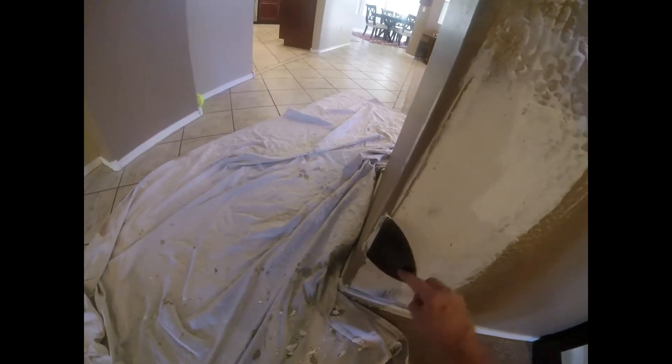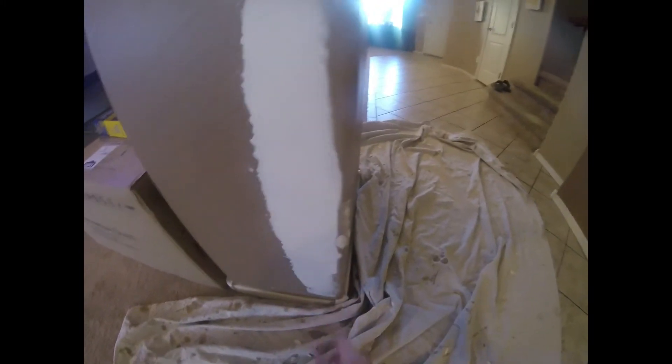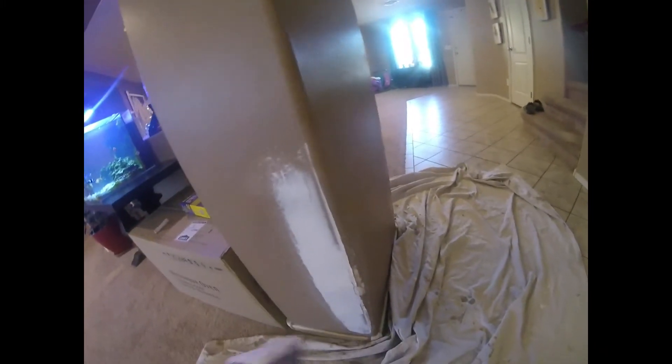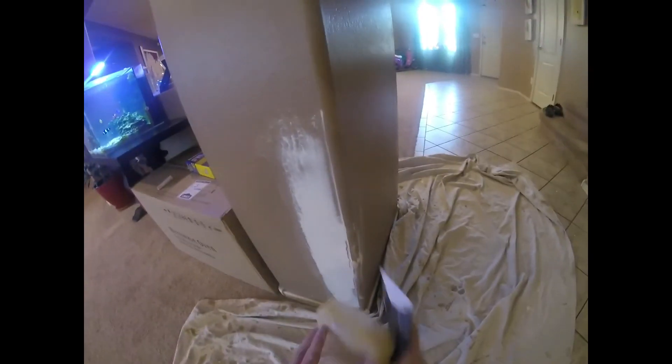As you can see on the corner bead, the dent is filled in. That's the point of impact — that's what popped this corner bead. A little corner ding like that created all this work, but this is the only way to fix it correctly. Both sides get the same treatment. I take the extra mud on my knives after feathering and use it almost like a second coat to fill in the ding one more time.